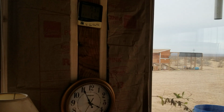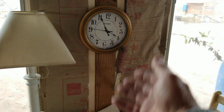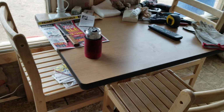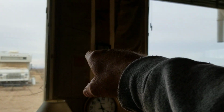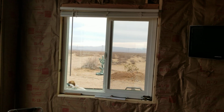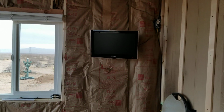And then if I have to plug the TV in, of course I can get one of those wire insulator things that cover the wires that come up from the bottom here and cover it right up the center there, up behind the TV, because I do have a receptacle there and a receptacle there, and I thought about putting another one in between the 2. Don't need it. I'll just do it that way. And maybe I can even just, if I'm going to bring an antenna wire over, I'll just come off of that box right there, follow the antenna wire over, come down the same hole, and put another box right there for the TV. So the receptacle is hidden behind the TV. Well, function before beauty, but what the heck, that'll work. Anyway, that's why I didn't tuck that in. And that's where we stand.